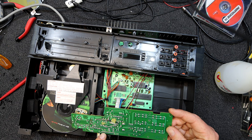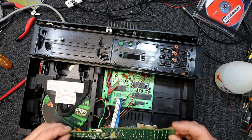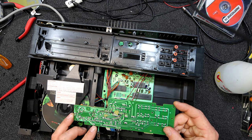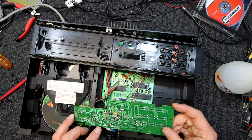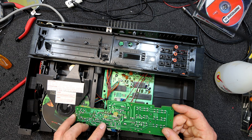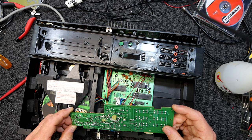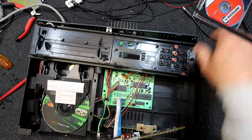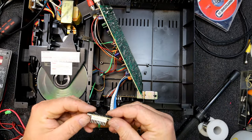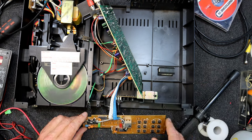I wonder if they're the common cathodes or anodes for each thing, but there's just not enough connections here really. I'm not actually sure what a 4052 is. It's got like three pins joined there, another one there could be power or something - that hooks onto one of these pins, with two pins possibly hooked to go back to the white wire. So that's quite a complicated mess. I did have a quick look online and couldn't find a manual for one of these anywhere. I've removed the display completely and it turns out it's actually got a chip on the back - so that could well be what is the actual problem running these segments, and I may have been blaming the Philips ICs unfairly.